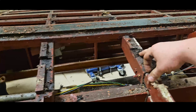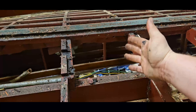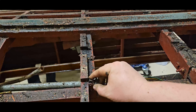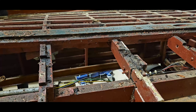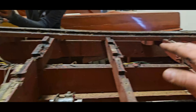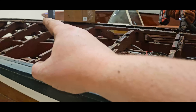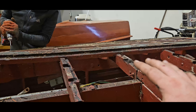We'll unfasten it from here, from here, from here, and possibly this one — it's already kind of unfastened. Then we will put a jack or support underneath it and attempt to slowly raise this keel up a little bit. We can either put shims on these or rebuild new ones — we'll have to see when we get there. The idea is to put some pressure on it outwards. Hopefully it's not too far gone. If we can get it to just being flat that would be nice — this one is actually supposed to have a little bit of an arc in the opposite direction.